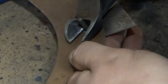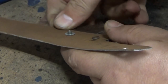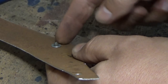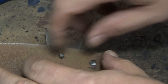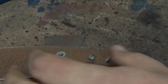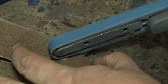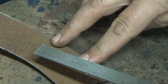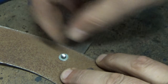Put the rivet down, lift up just a touch — a little bit more this time, because we're not going to peen it hard. Just make sure we touch it down on the edges. When the rivet is cut, it has an apex on it; when you rivet that over with a peen, you can end up with two strong burrs. What I do is just touch that off with a file — I've got a little electric file here. If you don't have an electric file, a hand file will do it; it'll just take longer. You can see we've got rid of that apex, flattened it down, which makes it easier to rivet.